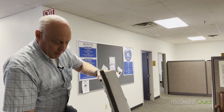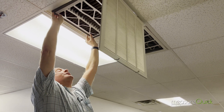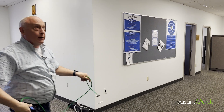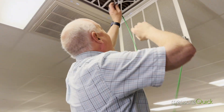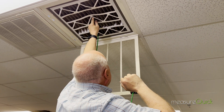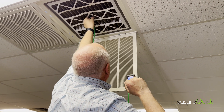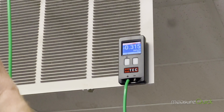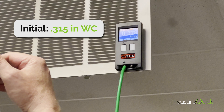I'm going to pop it back up in there just for a minute, and we'll get a pressure drop across it so you can see what kind of pressure drop the filter has. Let me get a nice little tech manometer here. You may want to come over to the other side — I'll put this manometer right here. We'll just poke up through the filter media. There we go. We're at about fully loaded, and this filter is six months old and it's a MERV 13. We're at 0.31 inches of water column.